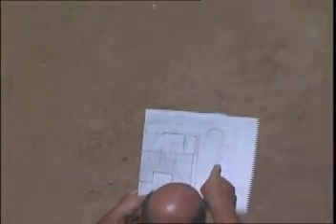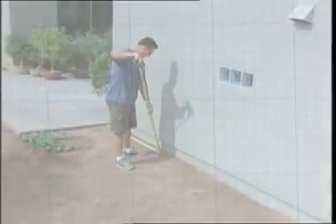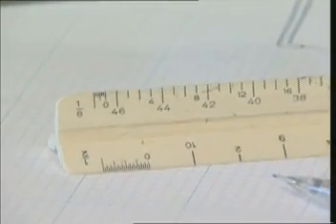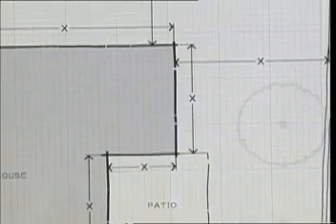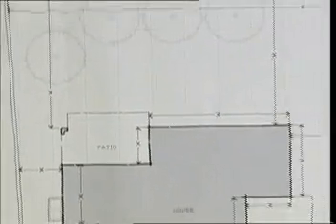To begin the process of installing an irrigation system, it'll be necessary to develop a simple plan showing the layout of your residence. Graph paper will make this task easier. Begin by measuring your house from corner to corner and, using a scale, sketch the outline on the graph paper. An architectural scale is available at most art or office supply stores. Mark the outline using the one-eighth inch equals one foot scale. After the house outline is drawn, measure out from all sides to perimeter walls, walks, patios, pool, or other structures. If your plan is within six inches on any dimension, this will be adequate tolerance to lay out the irrigation design.